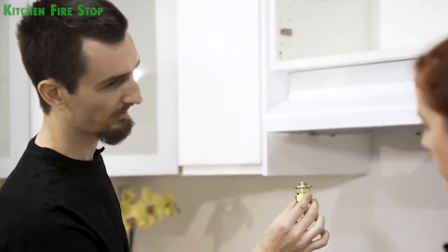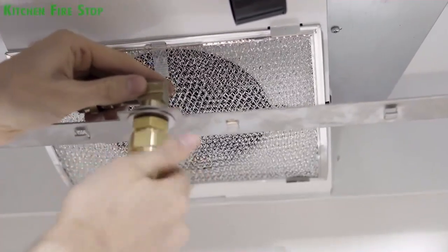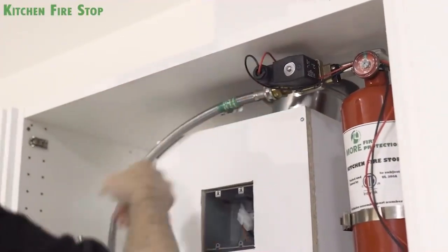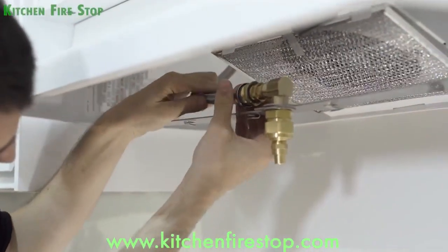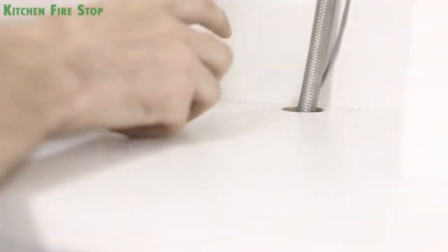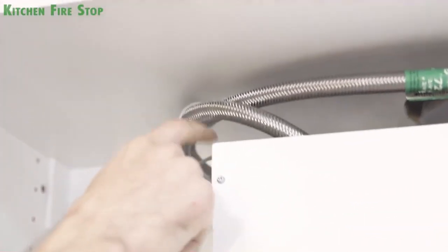We'll connect the nozzle to the edges of the burner and make sure that the nozzle's straight edges are parallel to the wall. After we have placed the nozzle and hose, we need to install the heat detector. At the top of the hood, the wire goes through the same hole as the hose did. Then we run it along the lower bracket to cover all the burners area. The end of line resistor is where all the wires end up and we fit it into the hood.